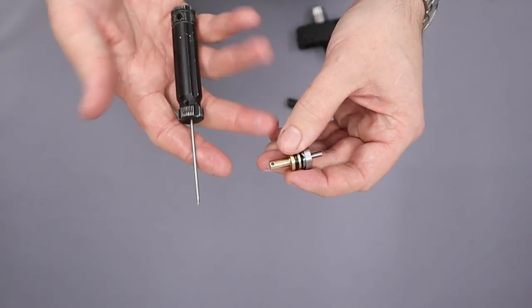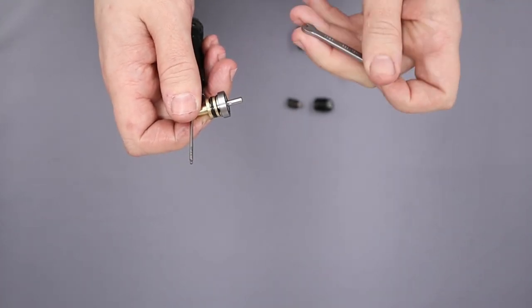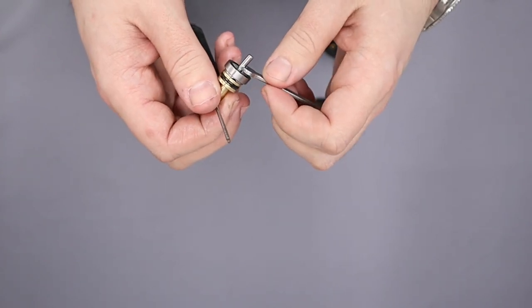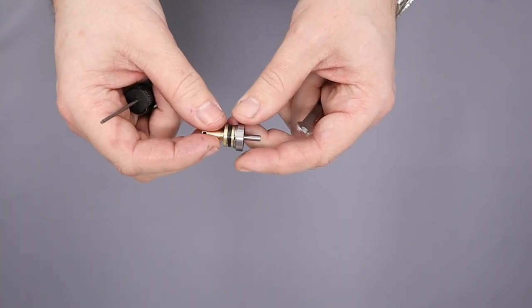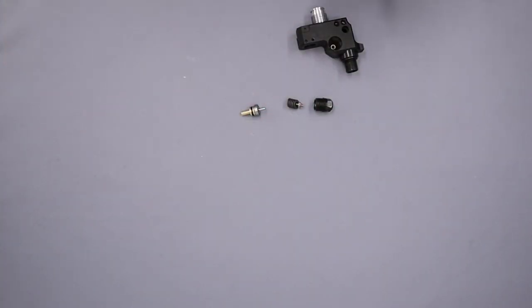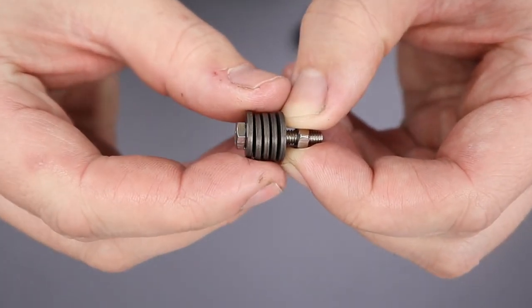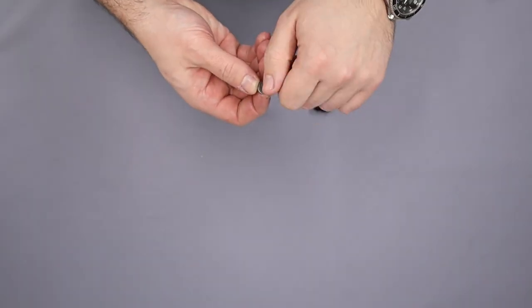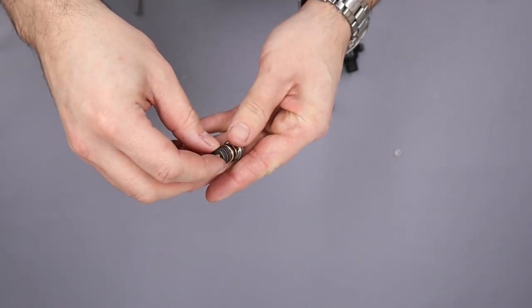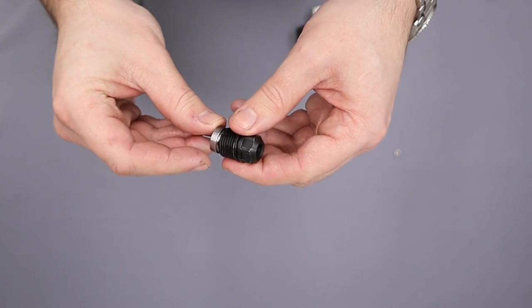To tighten the shaft I use a small allen key through the hole in the end of the reg piston, then take a 10 BA spanner and nip the shaft up. Don't do it up super tight as it's a small shaft and you might shear it off — just tight enough is good. With that done we can restack the Belville washers, which are cupped in pairs facing each other. We'll get those installed on the regulator piston and then stick the piston into the regulator housing.